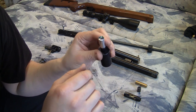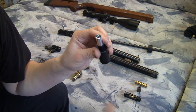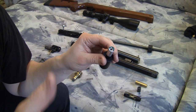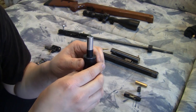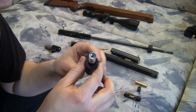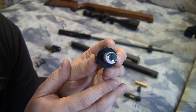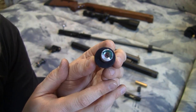The lower the pressure is set, the more shot count you get, because the pressure in the bigger part of the cylinder, so the unregulated side of the cylinder, has to drop a lot lower to get to the point where your regulator is set. So, of course, that means more shots. Right now, I have it set to 130 bars, although it looks more, but according to my tests, this is 130 bars.